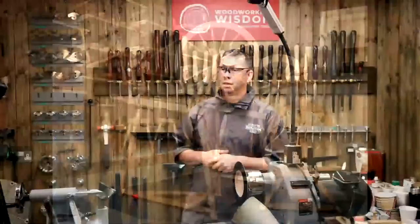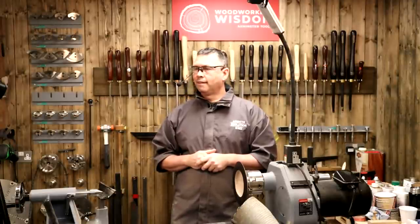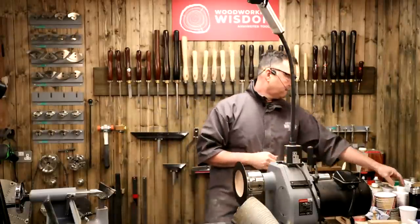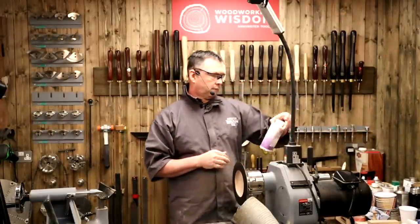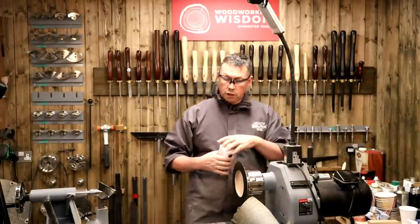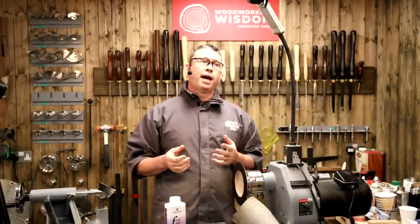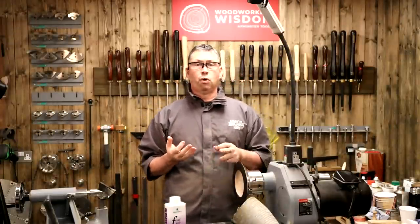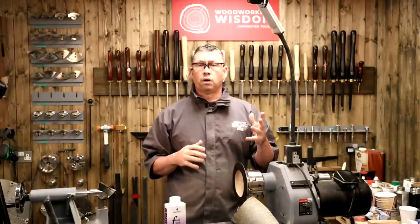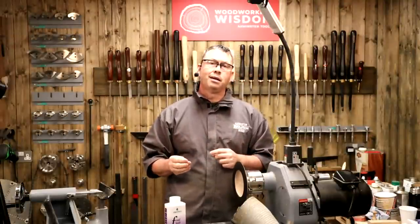Thank you, Ben. Okay, question from Paul. Will you cover food safe finishes, including the process before adding the food safe finish? For example, do you use a sanding sealer and then the finish afterwards? Food safe oil. So we're going to do an oil finish, but food safe oil is no different than, say, applying a finishing oil, applying a Danish oil, a lemon oil, walnut oil, tung oil, any of those things. They're all done in the same way. You don't apply a sanding sealer before an oil.